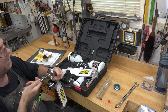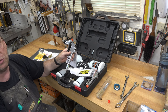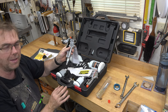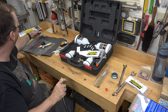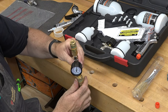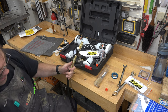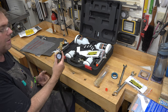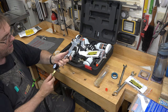What we're going to do now is get this hooked up to the compressor and test the system for air leaks — making sure there are no leaks in the gun, the inline regulator, or the hose connection. We'll pop the blower gun off and place our regulator on here. So far no hissing, no leaks. It's showing 85 PSI, which matches what my compressor is showing — a good little accuracy check. We'll pop the air gun in as well — again no leaks, which is a good thing.